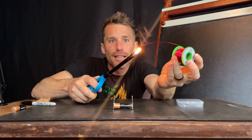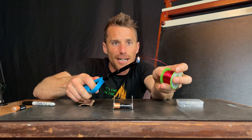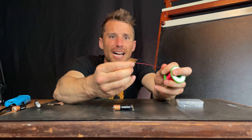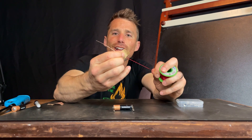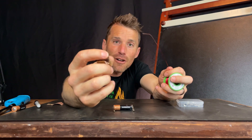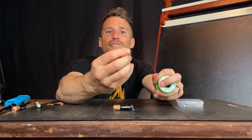I'm gonna burn it off. This is called magnet wire, and this red enamel coating keeps the current from flowing through it. I'm gonna get a nice long stretch here. Trying to get it all nice and shiny. We want the current to flow very, very easily. This is just a little piece of sandpaper — I also use steel wool for this. Works great. Something rough.